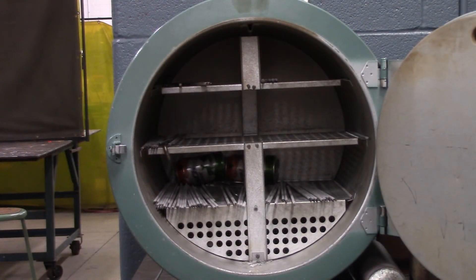This is what the inside looks like — it's got different compartments for different diameters of electrodes. I know somebody put some cans in there; I think they were trying to weld cans together so they put them in there to dry them out. But the name of the game here is to get rid of any hydrogen, because hydrogen causes hydrogen-induced cracking. That's why we have this rod oven.